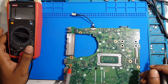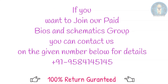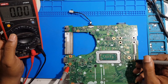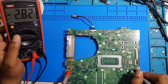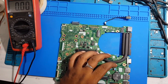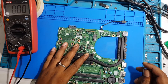The board impedance is good. I have connected the CMOS battery here, and we will directly check the RTC pad. This is the RTC resistor, RTC reset, and SRTC reset — both sides are having voltage 2.8 and 2.9. So RTC we can say is also good; it's not having any shorting.